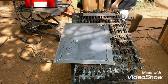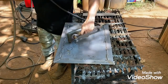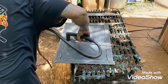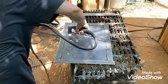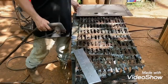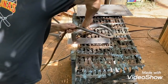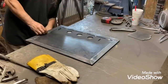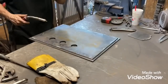This is a circle cutter - I have a new circle burner that's supposed to be coming. This one was made for a torch and I just made a different part for it to go on the front that'll hold the plasma. It does good, but I've got another one coming to see if it's any better. Hopefully it is, because the way I got this one, it doesn't have the bearing right there at the cap, so you have to walk around it - you can't just spin the whole thing. Sometimes it gets in the way, it doesn't always.